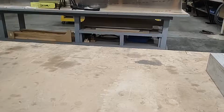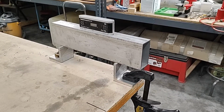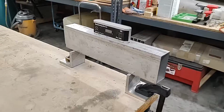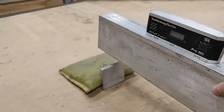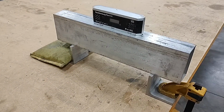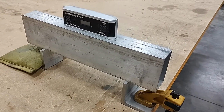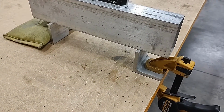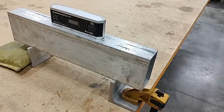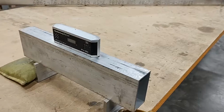Now, as I've mentioned in my rudder builds, it's very important to make sure that these surfaces are perfectly parallel to each other. So what we do is we set up a straight edge across them. We take a measurement. We bring that same straight edge to the other side. We take a dimension, and then we make sure that it's perfectly parallel. If we need to shim, we can choose which of the angles to put something underneath. It could be a shim of aluminum, 16th, 20 thousandths. It could be a playing card if you need.